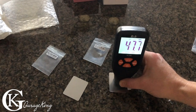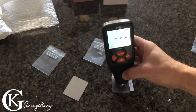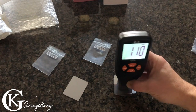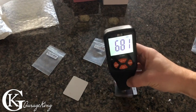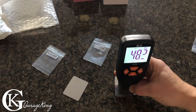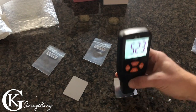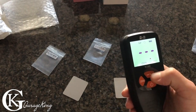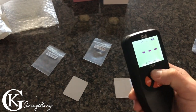Now I should note: when you have it on the single reading mode and you're quick and sloppy, you can get a wrong reading. Look at that — it reads 110, and when you set it down it stays at 110 and doesn't adjust. So it's almost better to use continuous mode. This way if you're moving around, it'll keep updating until you actually set it right on — there we go, 49, 50, which is what the shim was. Remember: microns are one thousandth of a millimeter, and mils are one thousandth of an inch — either metric or imperial.